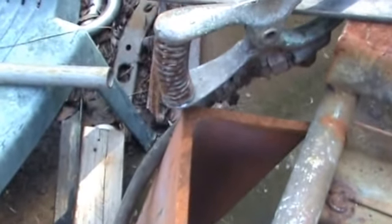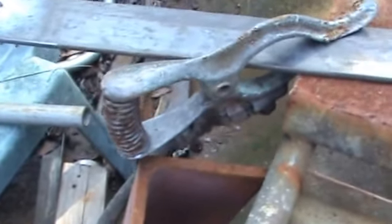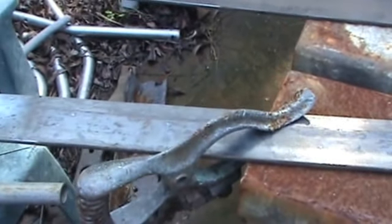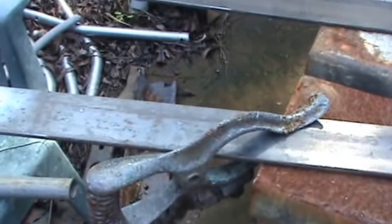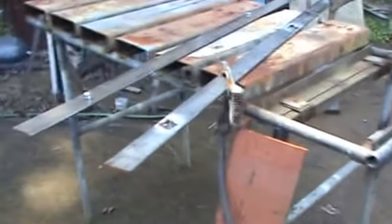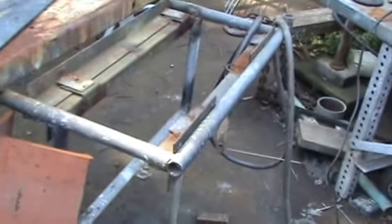Anchors. Then I gotta take these to Kukui and run a center drill down through these holes, just to make sure that the holes that were already drilled, especially for the center holes. And then the other holes, I'll take an end mill, and I'm gonna open those holes up in the truck bed, so that I have a little bit of leeway when I install these racks.